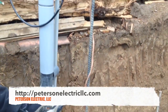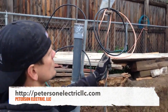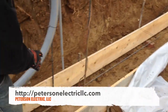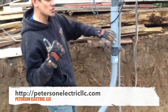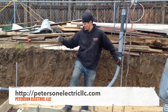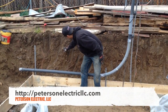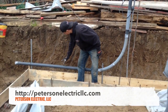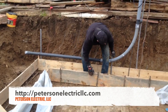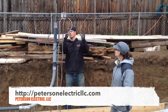So when Keith and them put the stem wall in, this will be in the stem wall and will poke into the crawl space — we'll drill the header and push it back out and go up into the panel. Now this right here is implemented because he wants to feed a two-inch PVC to the garage later with a hundred amps, so we may put a number 2-aught copper and run that over. We just put this in right now at two feet deep. The minimum requirement is two feet and the power company is going to come in at three feet, which is right at the base of this trench. Excel is going to pop up right here at their meter, and there's my panel.